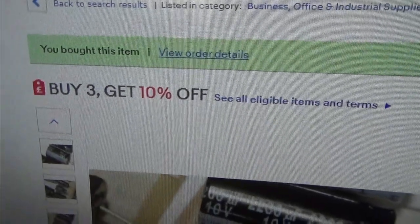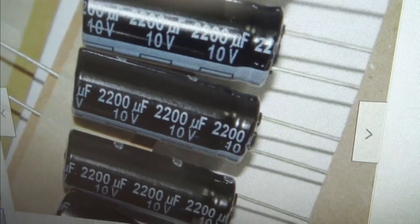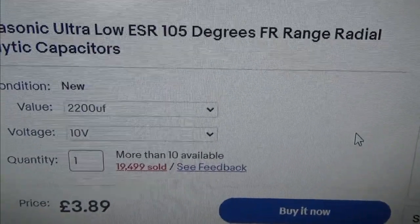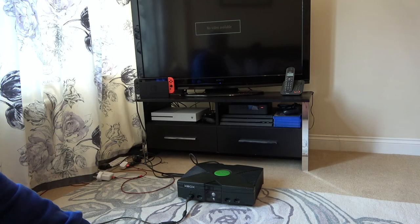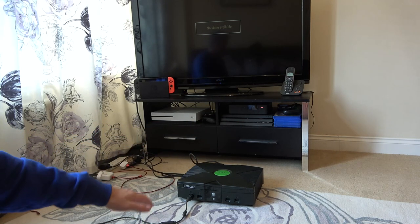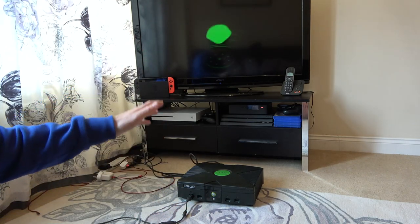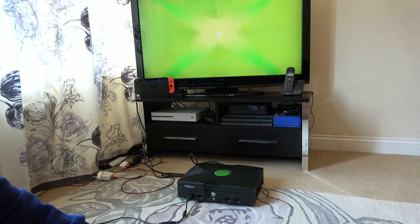Through the beauty of editing, we've jumped forward a few days after I ordered the replacement caps from eBay and soldered them in — and the Xbox is now working perfectly again. Replacing those four caps cost around three pounds, a little bit less, and that's for good quality caps. Now every single time it turns on it comes up straight away. It doesn't do the boot loop thing first, and you can see the red and green light has gone.